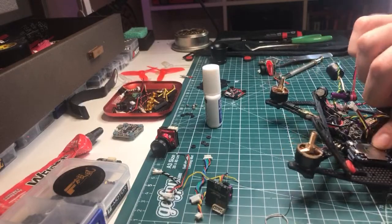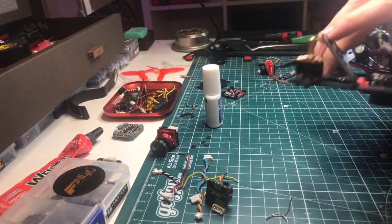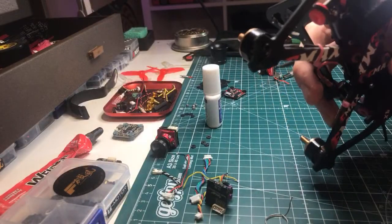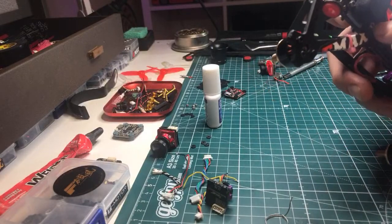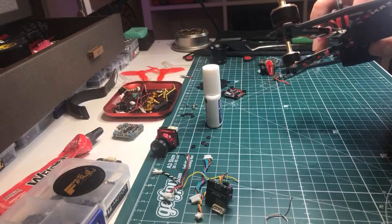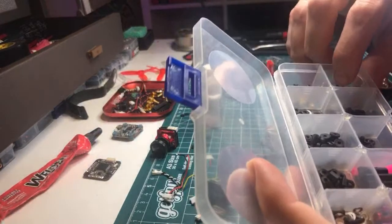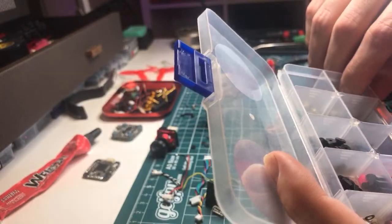All right, so this is in. Like I said, I ran the screws down from the top because this shield is way too tight for the nuts. And then I put the nuts with a ton of Loctite on the bottom. Hopefully they don't back out. If they do, I will put a longer M2 screw through here, and I'll run Nylock. You can now get M2 Nylock, which I should have done just now. I'm just realizing, but whatever. I didn't, and we're moving on.